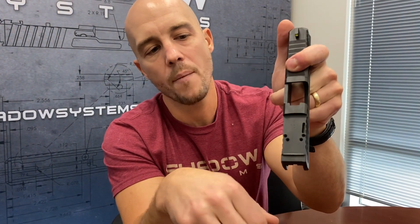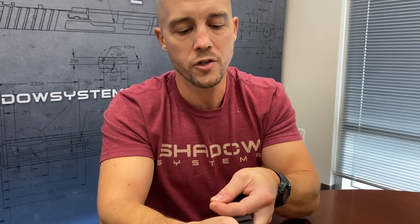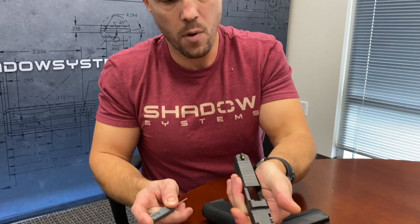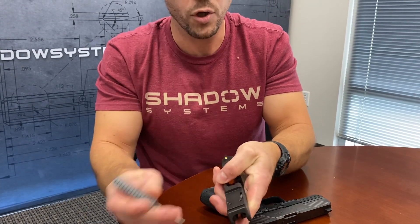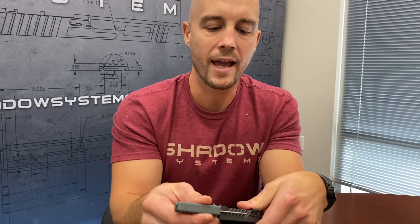So now to reassemble, you have an access slot on the top. You could actually use a small screwdriver to manipulate the spring, but that's a little bit of a pain. The fastest way to do it, actually, is with the longer armorer's tool. So you compress the depressor plunger from the back and get the pin started like this. Now the pin is partway in, and then you stick that tool in a second time and just straighten out the pin as you push it into place, and the pin is installed.